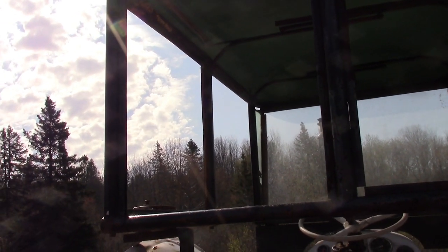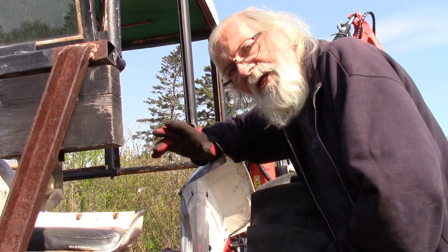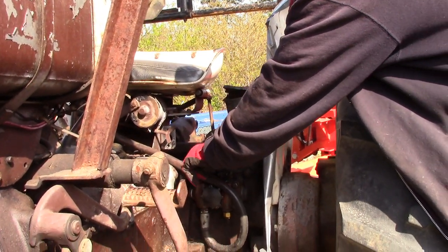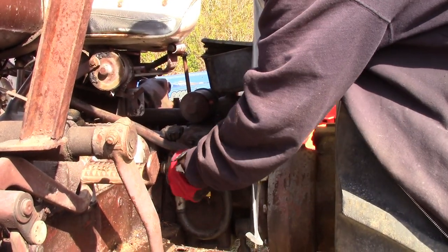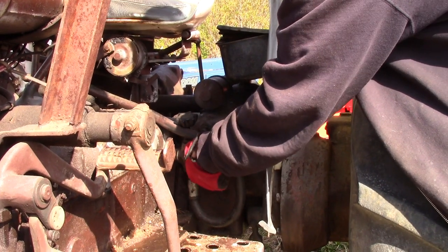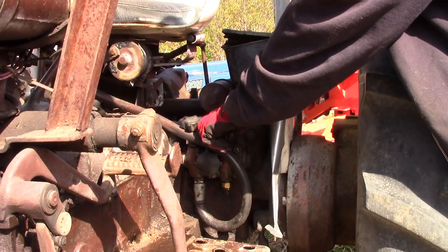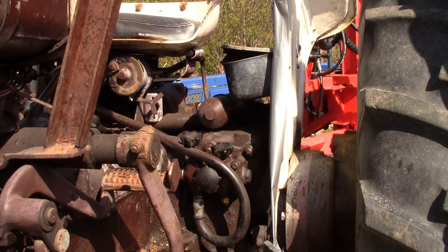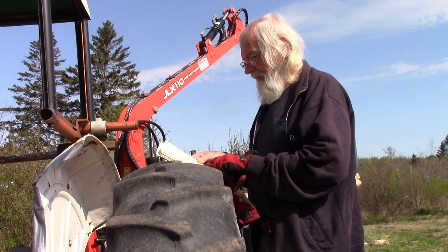After that we need to adjust the valves. We have three totally different valves. This one is for the external hydraulics, which needs to be open — that's open. This one here is for the three-point hitch and needs to be closed. It seems to turn a long way. This one, I think, can be either open or closed — we're going to try it first closed. Let me check the book.